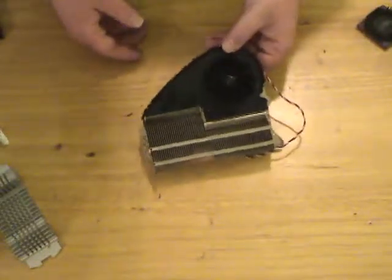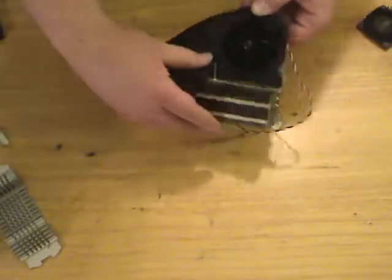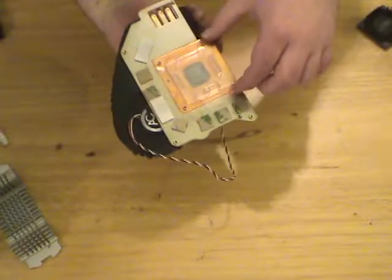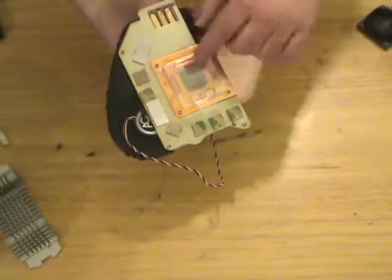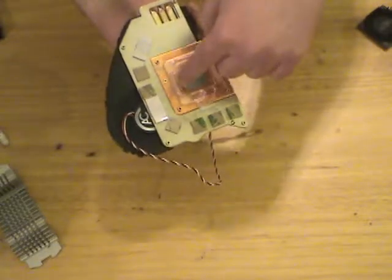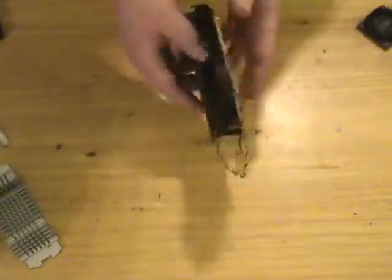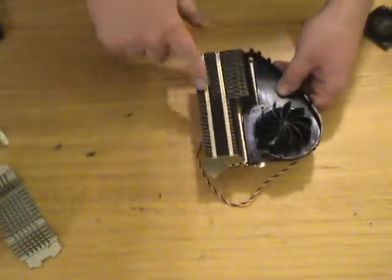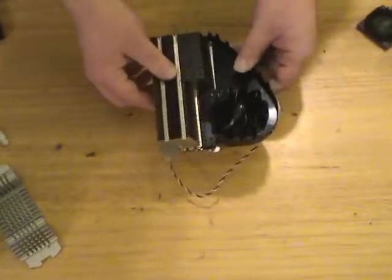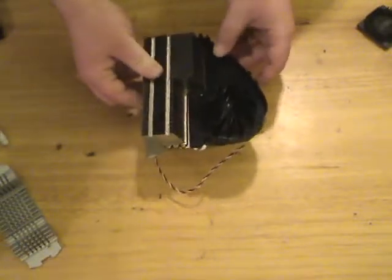And what I have here is an aftermarket GPU cooler. It actually uses heat pipes which run along and are connected to each one of these fins, and they're connected on the back to a copper plate that touches against the GPU using your Arctic Silver thermal paste and will cool or heat the pipes, and the heat from the pipes dissipates down each pipe equally and then gets cooled by the fins. This model happens to be great for the card it was designed for. I tried using it for a more powerful one, didn't work out so well.